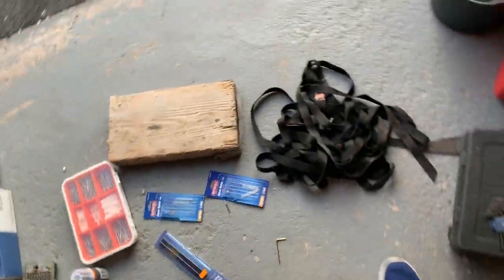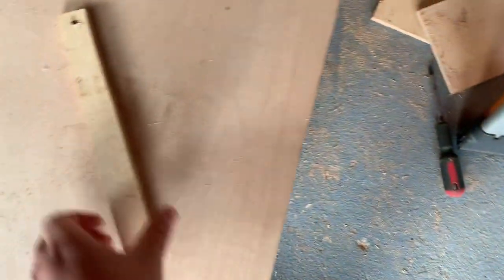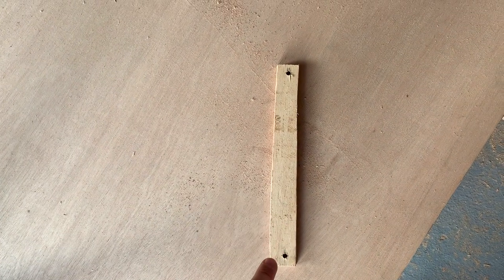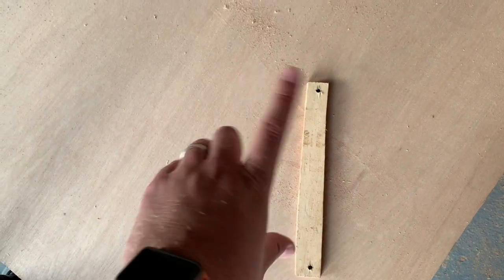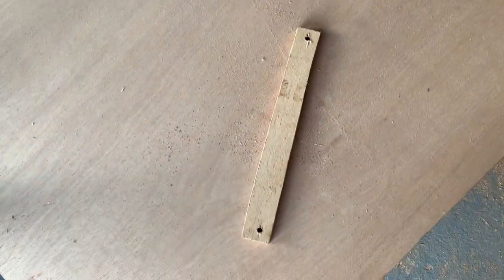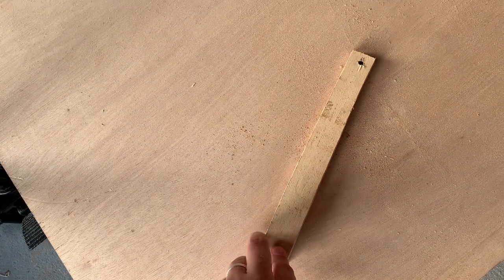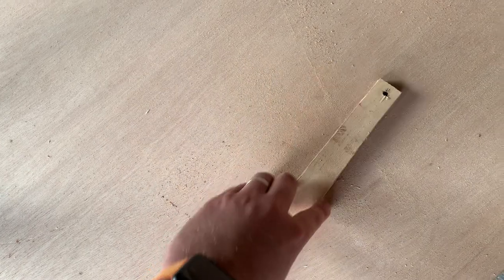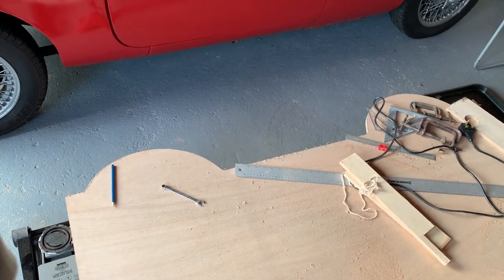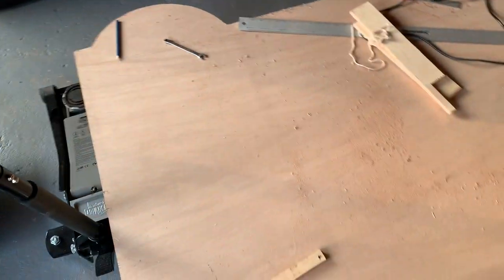I have been using these carpenter pencils, but to be honest I find a normal HB just as good. Something else I made — this very important little piece of wood. I think it's 223mm is the radius for the wheel arches. Now I only have a small mathematics compass, something like you would have used in school. So what I did was I made this from a scrap piece of wood, measured the two holes accurately, drilled them out big enough to put a screw through one end, put my pencil the other, and get your perfect radius — which I think has worked really well. I made sure one body side was absolutely right and then used it as a template to cut the other so the two would be absolutely identical.